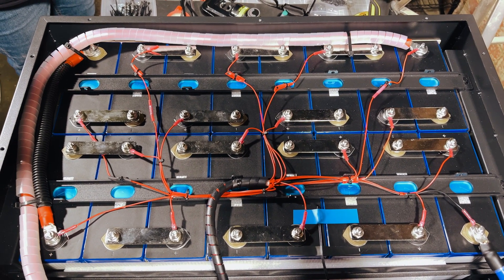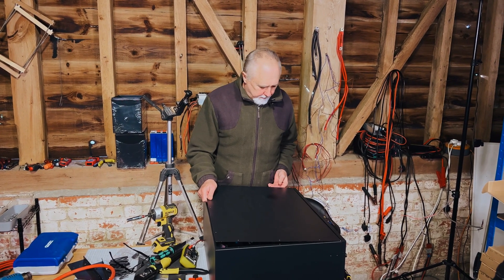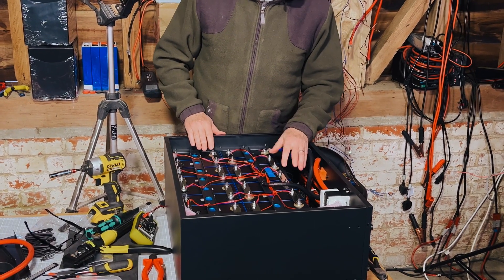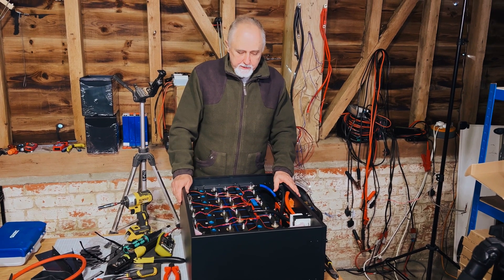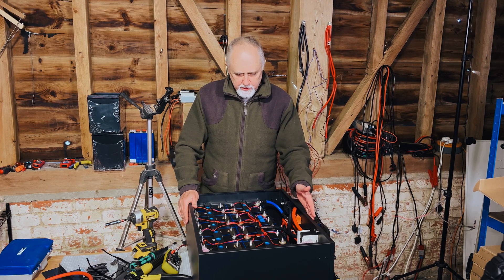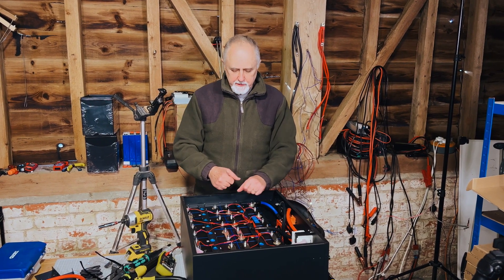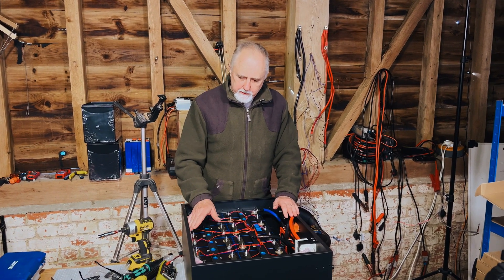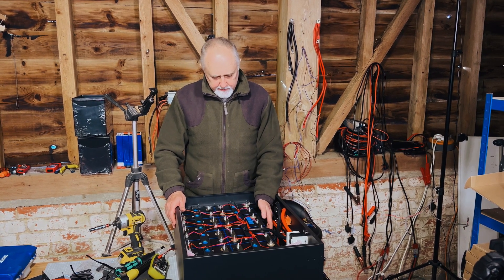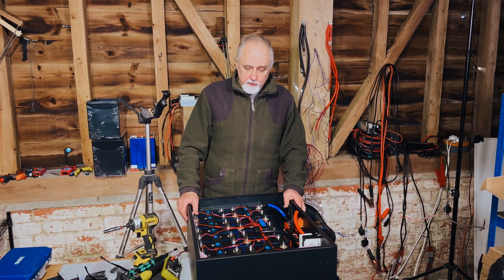About 110 kilograms of weight, so it's going to be a bit of a beast to pick up and put into the vehicle. That's the build of this battery complete. These are 304 ampere-hour cells and there are 16 of them — 48 volt nominal but actually 57.5 volts in reality. The case is specially designed for these cells — the exact length to fit them in with 3.5mm ply on either end so the cells can expand and be constrained. We've used 50mm cable, gone a bit overboard, but we don't want any voltage drop at very high current. It's a 200 amp 16S BMS with all the terminals built in. Really pleased with it. Hope you enjoyed this — see you in the next episode!